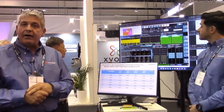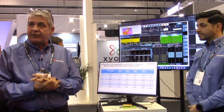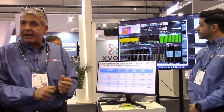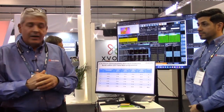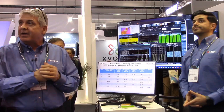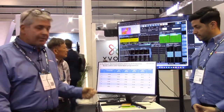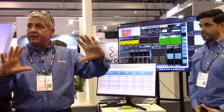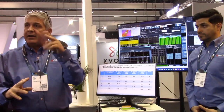We've prepared a series of six demonstrations covering portions of the N257 band that are going to be employed in Japan. Based on which customer is coming, we're going to show them their frequency band. Our last demonstration covers the entire N257 band. We can operate this antenna in three modes: use the antenna as one large 384-element array with two beams — a V-beam and an H-beam.